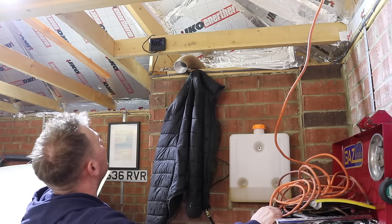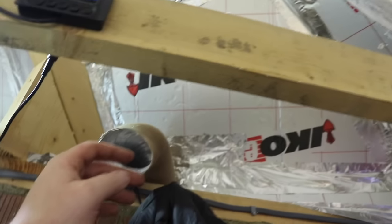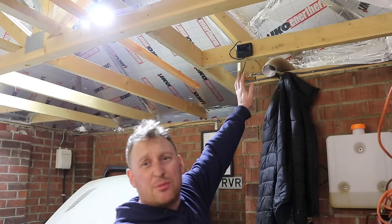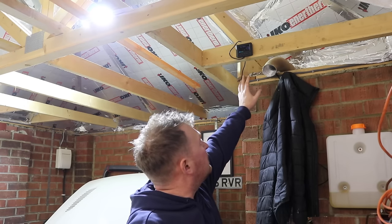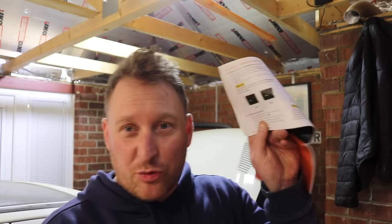I think it's working, we're pumping — not going to need a pump. The speed knob... I've got absolutely no idea what's going on here, it's not working at the minute. The fuel pump's clicking but it's just blowing cold. I'll get the instructions out. When I've read them it says: after about 3 seconds of turning it on the glow plug will heat up, then after about 1.5 minutes the fuel pump will start clicking, then after about 5 minutes the heater will kick in.